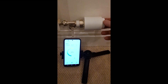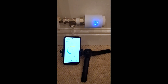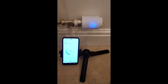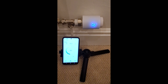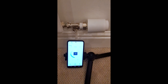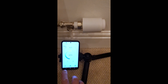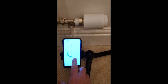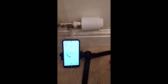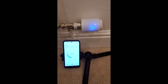I just wanted to show you how quickly the temperature changes between the app and the unit itself. There is a little bit of lag depending on which way you go. So that's gone down to 19 and then — there you go — it's updated. You can do the same thing from the app, going the other way with plus and minus. If I set it up to say 22, it's going to refresh and set the radiator valve to that setting in the background. If you wiggle the radiator valve it should show the temperature — there you go, 23 before I moved it. It does update; it just doesn't show you on screen if the TRV display is off.